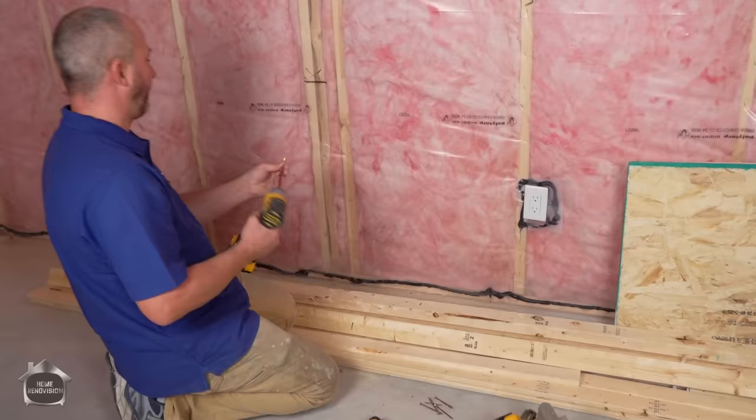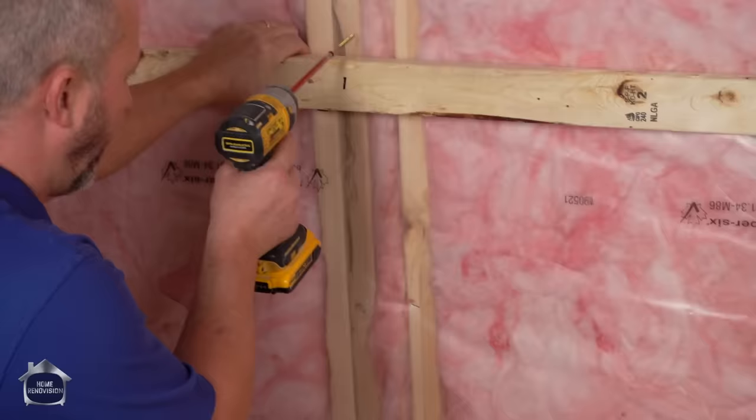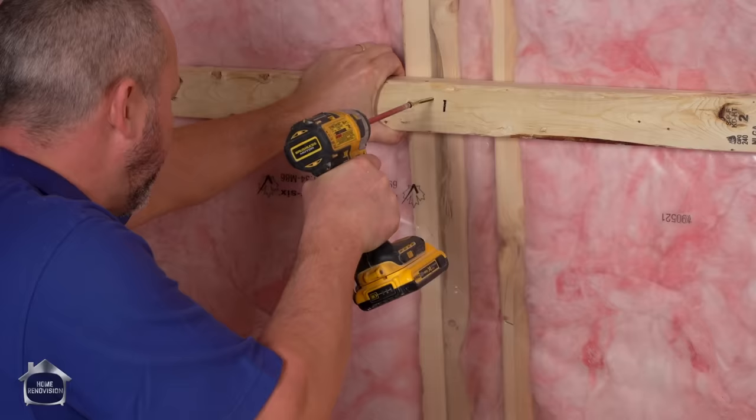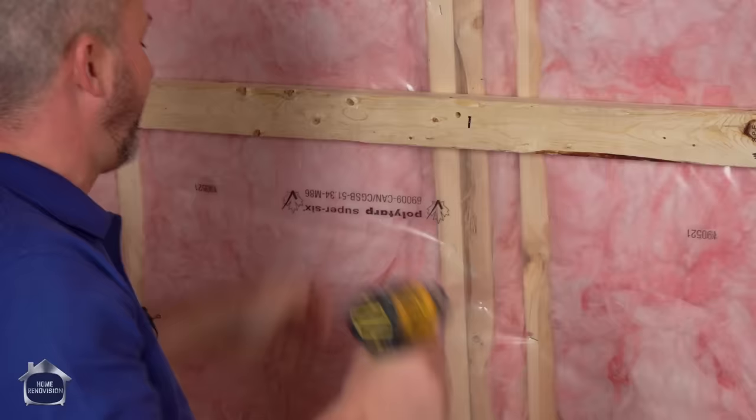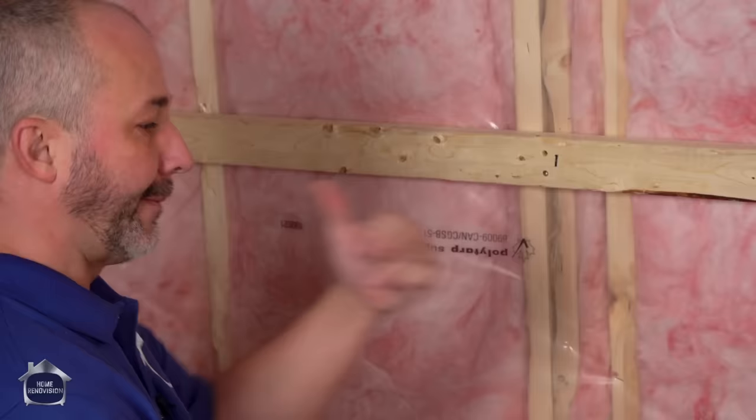Okay, now ready to hang. I'm putting these boards on the wall right on top of that black mark, and I'm going to have the mark that I marked at four feet — which is the middle — right off of this stud. I'm going to use everything that's existing here to make this make sense. Now, each one of these screws carries 80 pounds. You can start to see in a real hurry that between three or four locations on the wall and a couple of locations in the front, you can carry more than enough weight for whatever you're stacking on there.